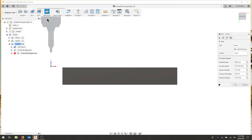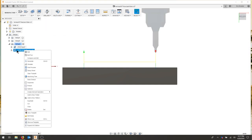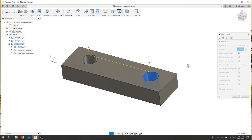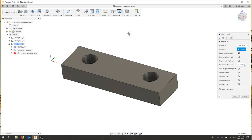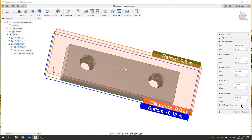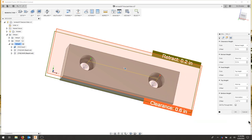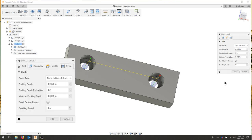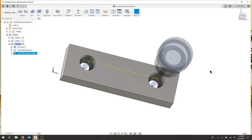I'm going to add another drilling operation. I can hit create derived operation — drill — and that'll stay the same. For my geometries, I'm going to deselect these faces and select these bottom faces here, so I can go through the whole part. For my heights, I'm going to select hole bottom, and I will select drill through with no offset. I'm going to do drilling, then change that to deep drilling full retract — I want to make sure I clear all those chips. I'll hit OK. I'm using a quarter inch drill so that I can put my quarter inch end mill into those pockets and completely mill them out.